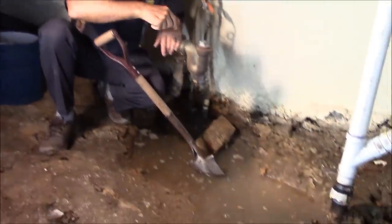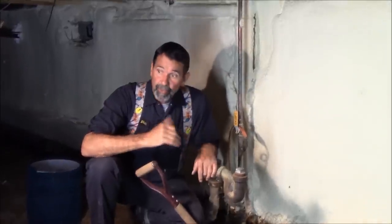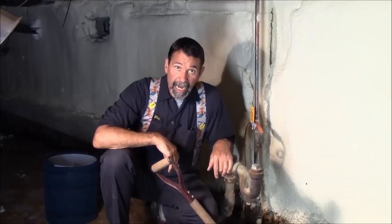It is going to short cycle — this is not the proper way to use a sump pump. However, it's a heck of a lot more convenient to have a pump with a float switch turn on and off than using just a standard utility pump I've had to plug in and unplug every 20 minutes to get the water down enough. Here's where our lowest lying water is — this whole area was under two inches of water. We believe it's rain water coming in from the front of the property.